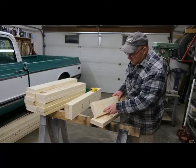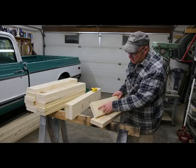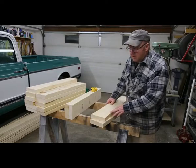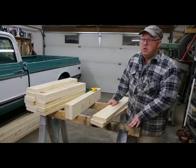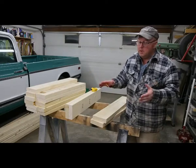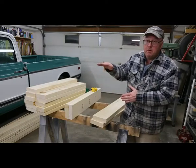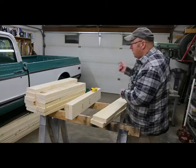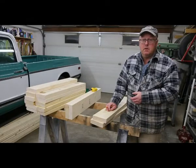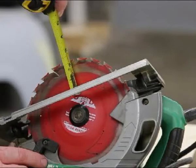So we have to cut halfway up this 2x6 here. Now, if you have a nice large table saw, that's not a big deal because your blade will actually come up far enough. But on my little table saw, the blade does not come up far enough to make this cut. And same with the skill saw. The skill saw blade, even all the way up, does not cut far enough